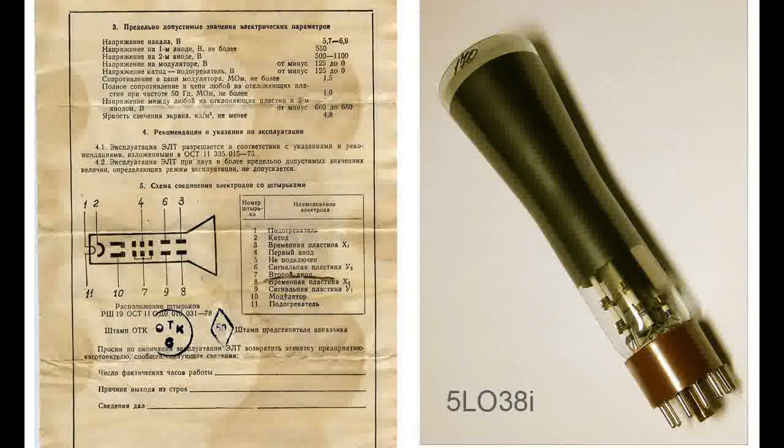So let's start off by taking a quick look at the cathode ray tube we'll be using. It's actually an ex-Soviet tube with a 5 cm faceplate, which is probably about as small as one wants for any serious fault finding usage. It's fortunately bought new in box with a double-sided specification sheet, although this is in Russian. There's no reason why many other small CRTs couldn't be used in this circuit as long as the data sheet is available.